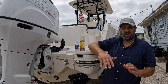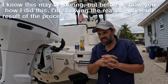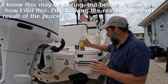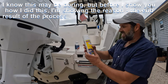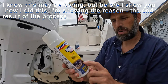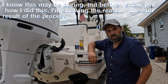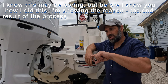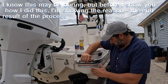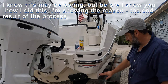Welcome back to Florida Keys Life. I just hauled the boat out about 20 minutes ago, and about two months ago I applied this Aurora VS 721 bottom coat wax — it has a biocide agent in it. I learned about this at a boat show, actually the Miami boat show, two years ago. I put that below the water line, from here down.